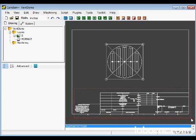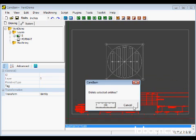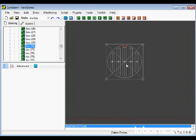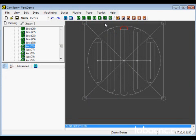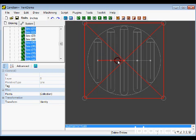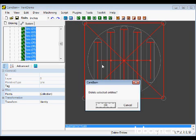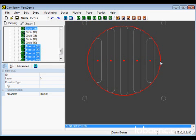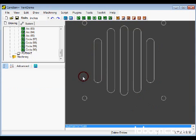You can do that by clicking and dragging to select multiple items, then hit the Delete key. You can also Ctrl-click to select multiple items and again hit Delete. You can use the mouse wheel to zoom in and out and re-center. Go through and select all of the construction elements used in the original drawing that we don't need for the machining — center points and a construction circle — and delete those. Now we're left with just the pattern we want to machine.